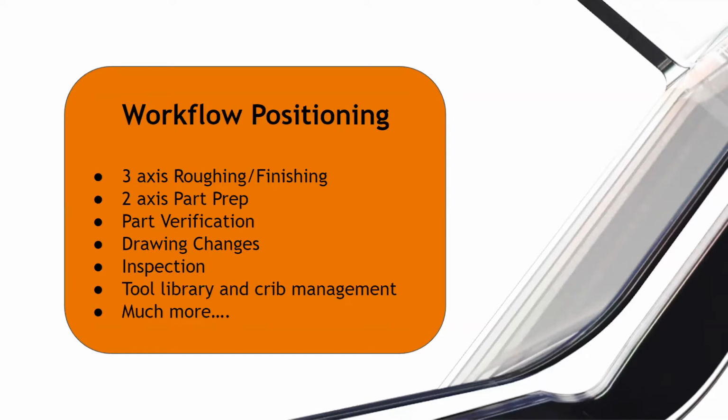And when it gets to my more bottleneck machine, right? Meaning a full 5-axis machine like a UMC or DMG or something like that, you don't really want to tie up those bottleneck machines just for roughing and just for doing simpler things. You want to make sure that you're maximizing the efficiency of the machines that you can use for all their full 5-axis simultaneous toolpaths, right?